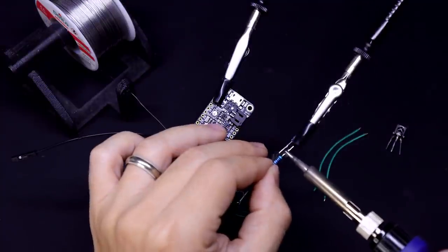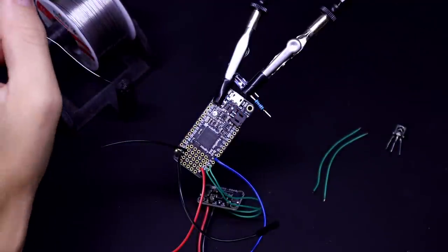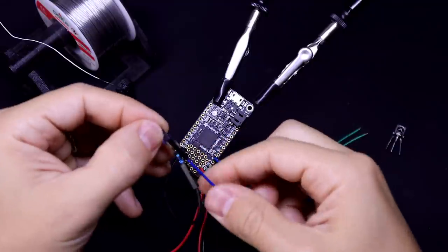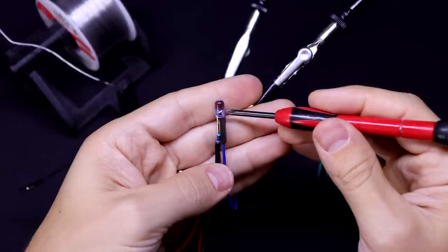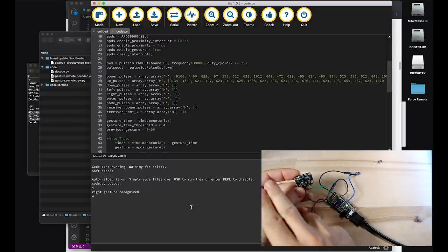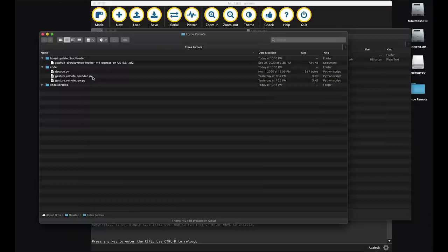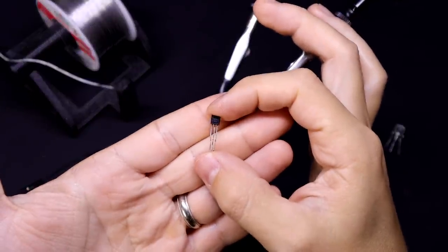Attach one end of the 270 ohm resistor to the ground side, and trim the other side and add some solder to it so that it's thick enough to use with the jumper wire. So we've got the ground wire connected to the resistor, and the blue wire connected to the positive. At this point you can give it a try. If you plug it into your computer and watch the output of the Mu editor, you should see the gestures being recognized and hopefully your TV turns on as well. If not, there are two things you can try: use the other version of the code — raw or decoded, whichever one you didn't use — and if it still doesn't work, try adding a transistor.